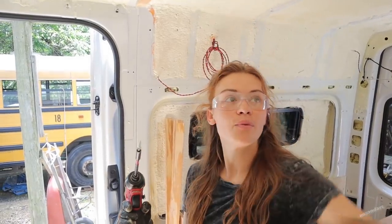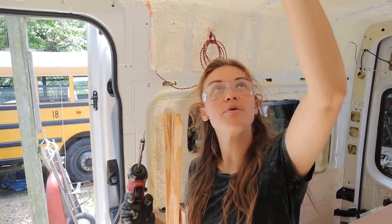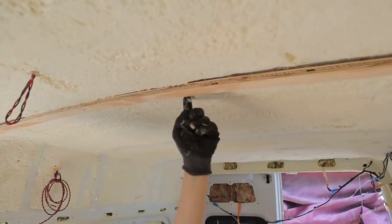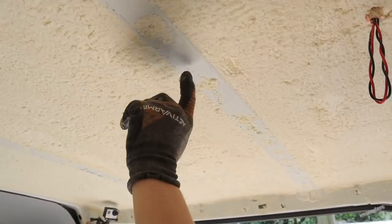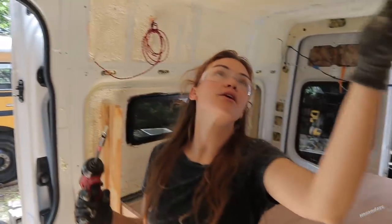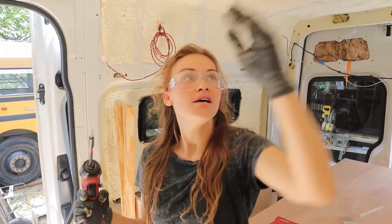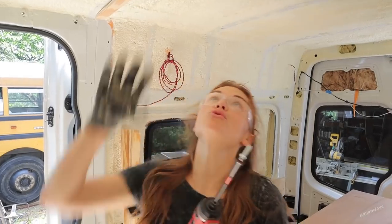We started on the middle one. You put the piece of wood, furring strip, up here, to the side of the metal rib underneath this. So for instance, right here on this one, you'd make marks where they're not holes. So here, here, here. You only really need 1, 2, 3, 4, 5 across the way. Put the wood back on top of the rib. We do lose half an inch in height, but you get more insulation.